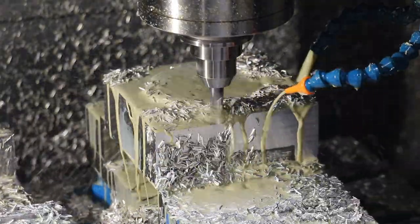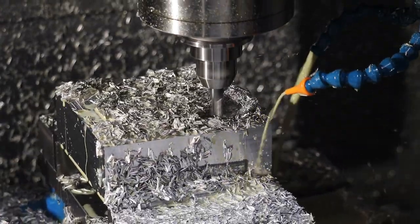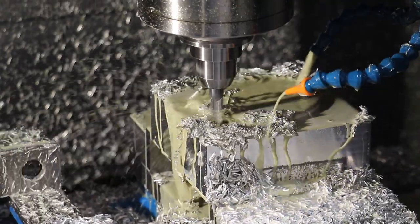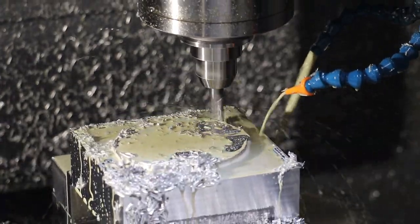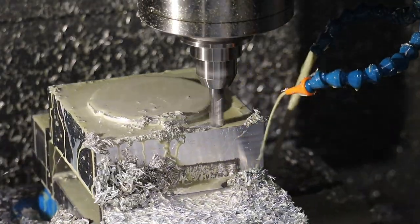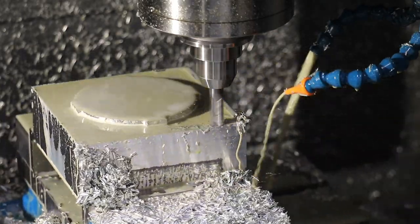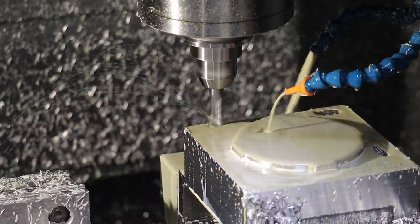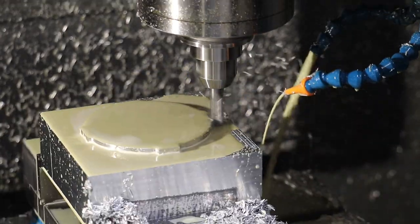diameter alignment ring. The molding machine also has a 110mm alignment ring in its A side platen. You basically just key this round boss, which you need to make slightly less than 110 millimeters, so take 50 microns or 75 microns off its diameter so that you can fit it into the molding machine without having to press fit it in.